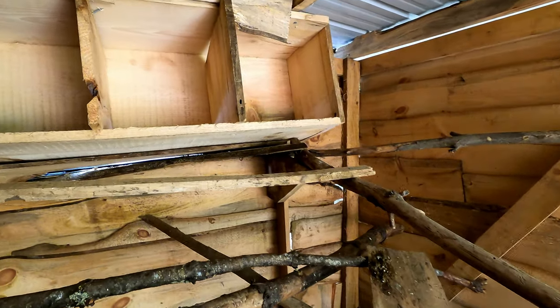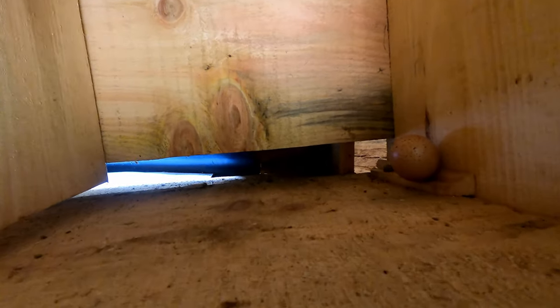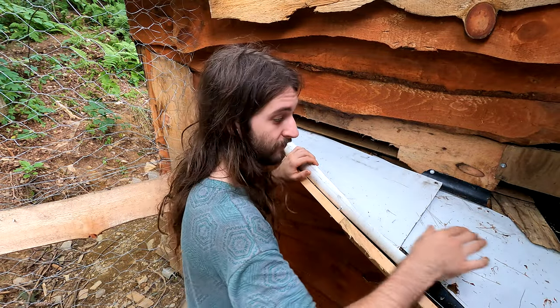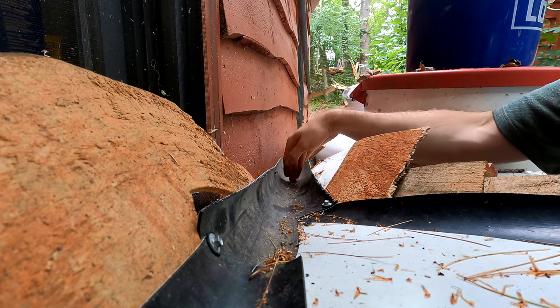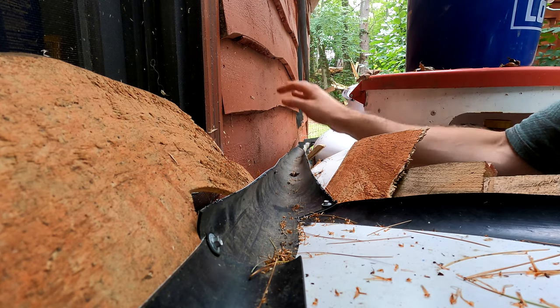This box is set up at a slight backwards and left-leaning angle, which is a common roll-away design. I formed a ramp from an old metal side and some bumpers from some PVC pipe that was cut in half. Then I added this angled chute and tilted it until the test eggs wouldn't get stuck regardless of their start position.